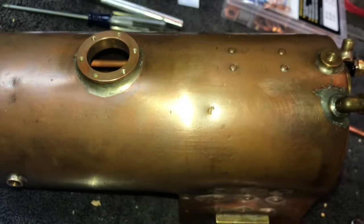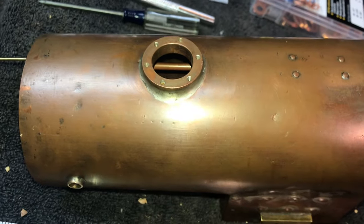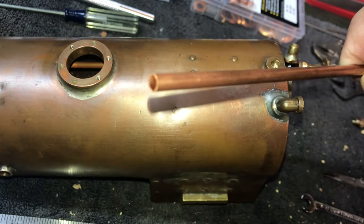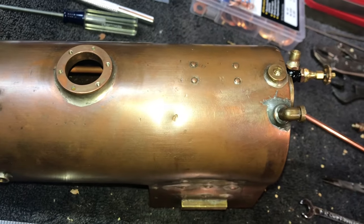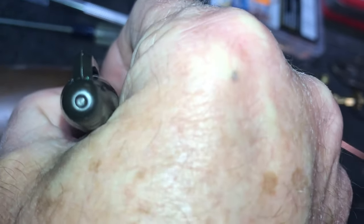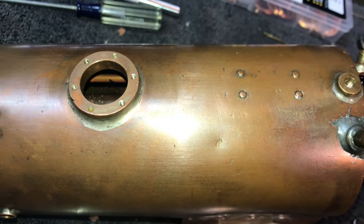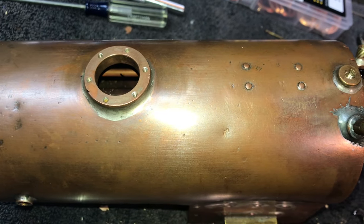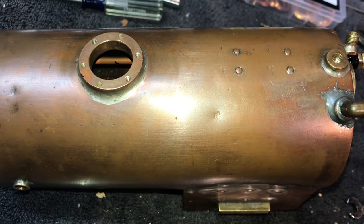My first attempt at making the blower tube — I had the length right at first, but then I screwed up the threads, and consequently it came out too short. So I got an idea: I can take a piece of 3/16 inch copper tube, and the 5/32 inch will fit just inside it, so I can make a splice. What I'm going to do is mark it right where the center is, cut the tube there, then slip over and make a little spacer or sleeve, and adjust the length that way. The worst case scenario is I just start over again and make another one from 5/32 inch tube.